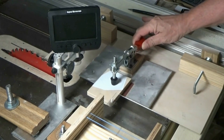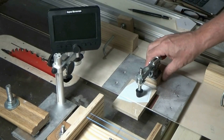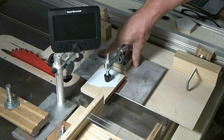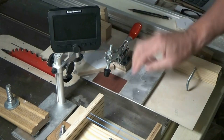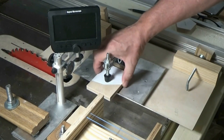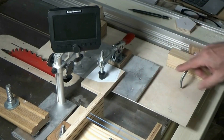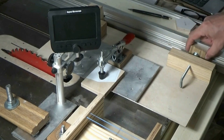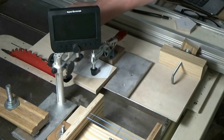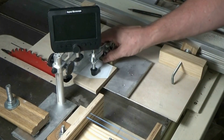This is my setup for cutting small parts on the table saw very accurately. It's got the jig itself, the sled, and uses a toggle clamp to hold the workpiece in place. It's got sandpaper underneath to provide friction to keep it from moving around once it's clamped down, and this edge is adjustable with these two screws. These have got two pieces that ride up against the fence that slide along, and these can be adjusted in and out to make real fine adjustments to the angle relative to the blade.